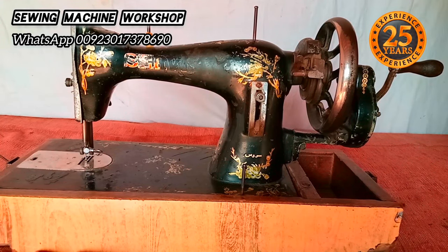From the start, I opened the foot presser, then checked the presser bar rod, and finally removed the hand wheel and realized the center of the crank was jammed. If you would like us to help you, please contact us through WhatsApp. Please don't forget to like, share, and subscribe to our channel. Till then, see you in the next video.